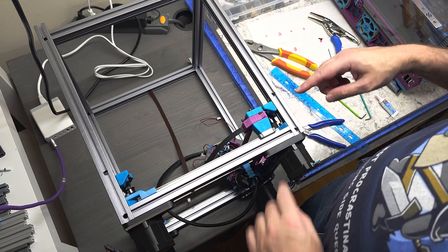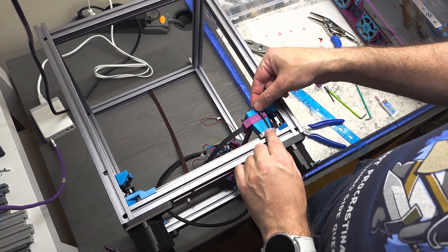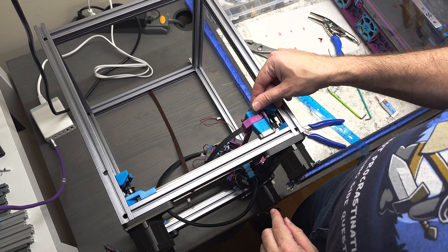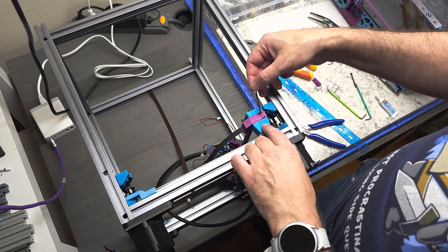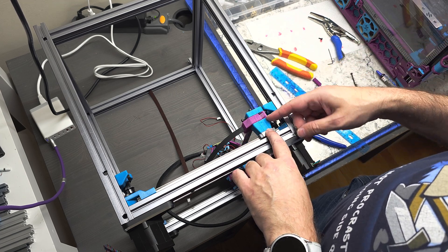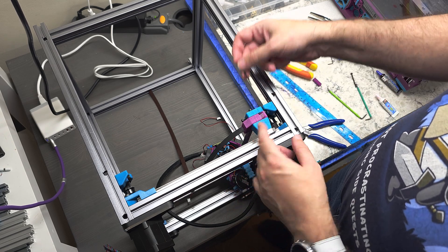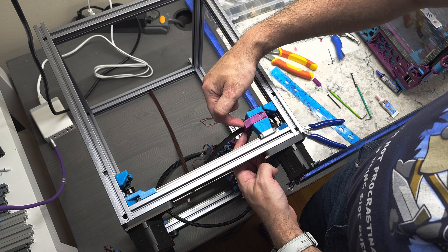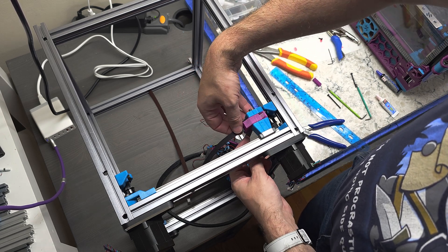The way to do this: when you have this assembled, you'll see there is a bolt — this bolt — the screw runs through these printed parts and into the carriage. We're going to remove this one. You can tell which one to remove because there'll be a visible gap here where you can see, and that's where we're going to route some belt. So I want to fully remove that bolt.